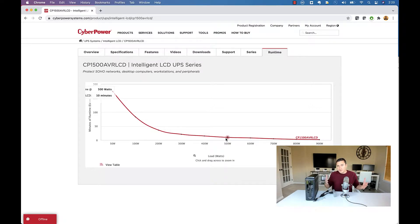So looking at that, based on the chart, I'm between 400 and 500 watts. I'm going to get somewhere between 10 and 15 minutes if there's a power failure. For me, that's perfect — I do have a generator. And in case it doesn't come on, I can end that call gracefully. If you've only got 100 watts on there, you're going to get 83 minutes, which might be more than you need. Or you can go down in size a little bit as well. That's basically how you size these things.